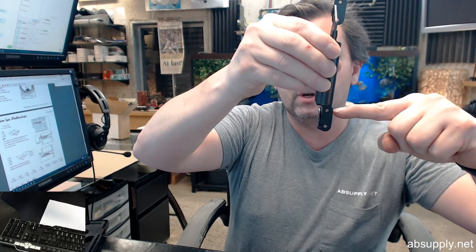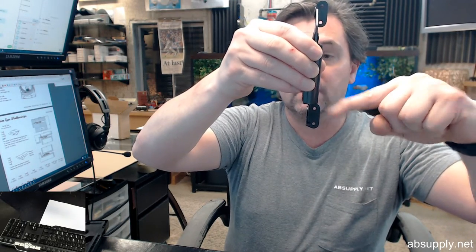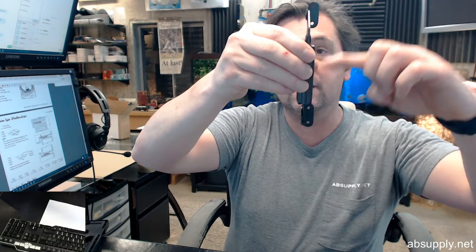Okay. Now the 703 installation is on the bottom of page 1, and the distance from the sidewall, not so critical really at all. I've seen 2 of these installed well towards the center of the unit, like a third in and a third in. The important dimension is that you are following the 1/16 dimension from the top screw to the top of the back of the unit, and then 3" from the bottom of the lid to the bottom screw. And if you have those laid out, then again, no problem.